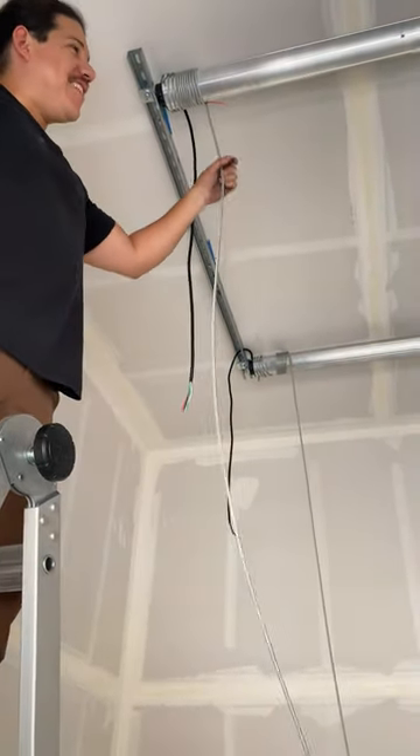We got the struts on, the motors on, and the control box powered on. Now it's time to work on the platform. The platform is extremely easy — think IKEA. You get a bag of 12 nuts and 12 screws. You need a 10-millimeter wrench and a 3/16 Allen wrench. The corner pieces and flat end pieces screw onto the long pieces, and the middle pieces have a bend and go into the two vertical holes. Follow the instructions and you'll get it done quickly.